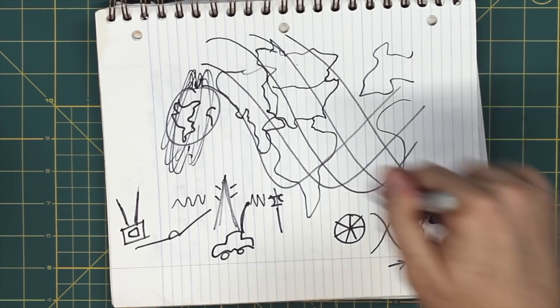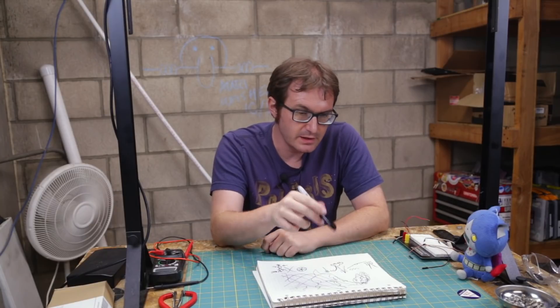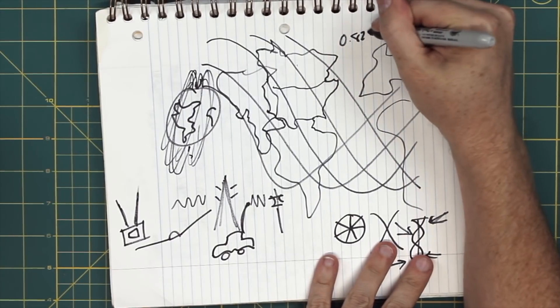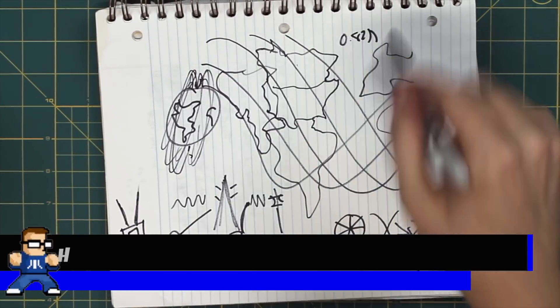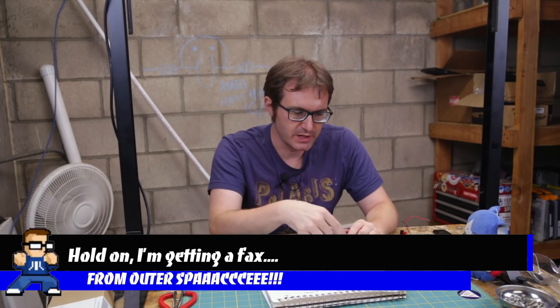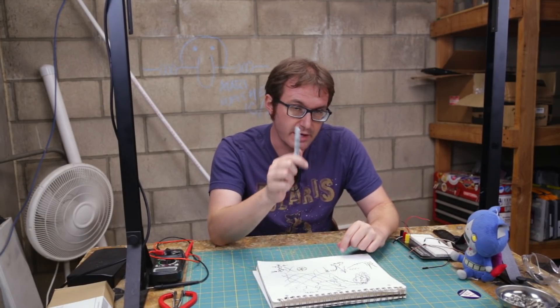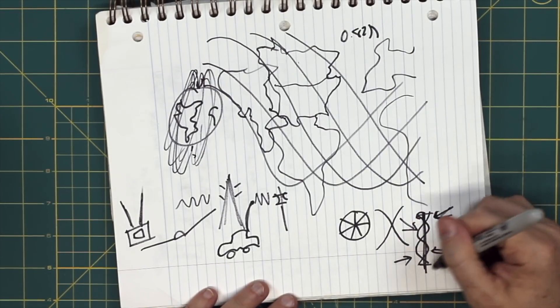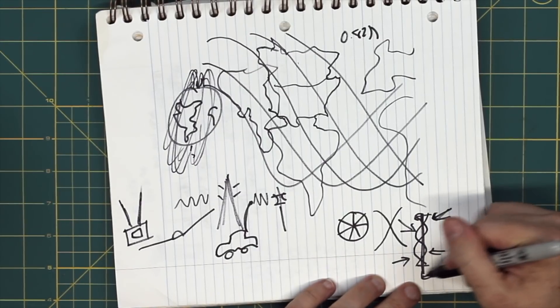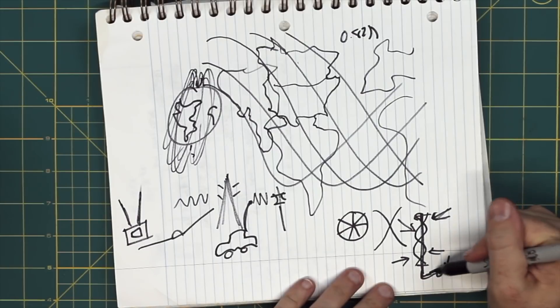There is a formula for doing this — something like 0.82 lambda, which is your wavelength — and that gives you how wide to make this helix. I'm going to double-check the math; there's actually a really good calculator online I'll use to get all the measurements we need to cut everything. Essentially you have a polarization, it runs down the middle and out into your coaxial cable, so you have your element in the middle and the grounded sheath is the other side of the antenna. That's what gets you the strongest signal with the most gain.